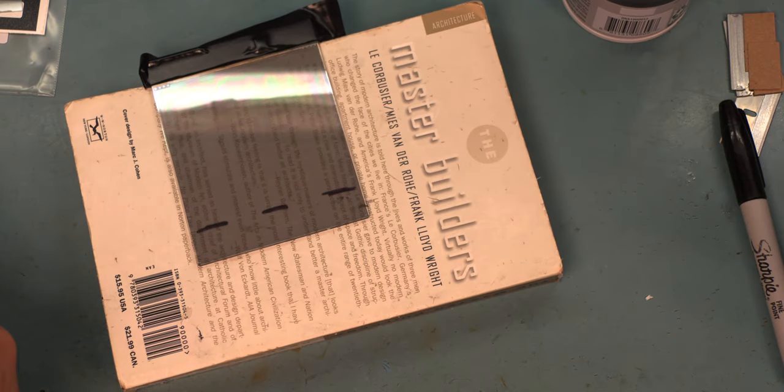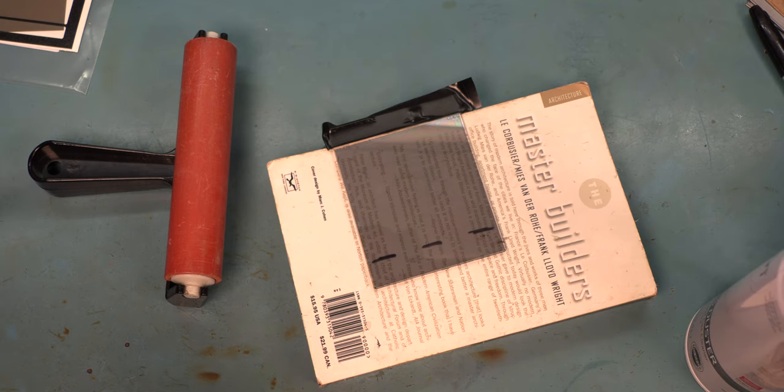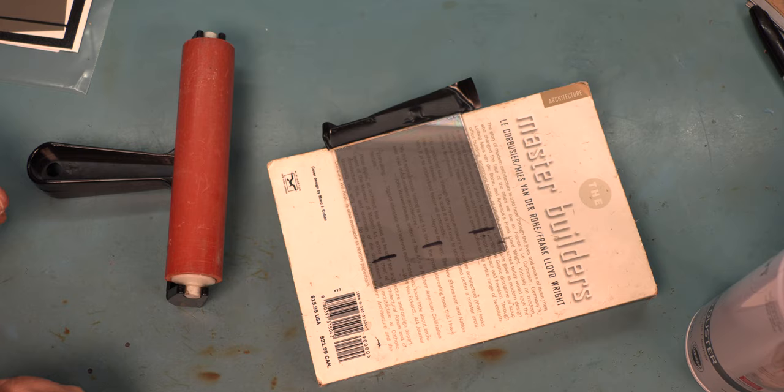We're going to apply the top panel to the top surface of the glass. We're going to use some compressed air to do a final cleaning on the panel. Make sure that any dust that's landed on the panel since we scraped it clean is gone. Then we're going to apply the top film and we're going to use our brayer. This is a rubber roller in order to apply that film. By popular demand, those rollers are available in our parts store for a very reasonable price.